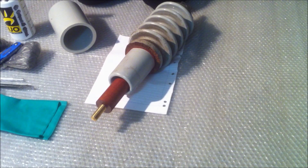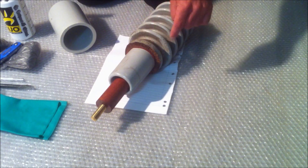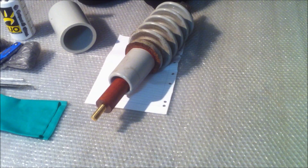Before we can mount this thing we've got to clean it, but the problem is because it's a really old unit, I strongly suspect that this is an asbestos-based gasket. So we're going to need to be careful when we're removing it. You can't just use power tools and grind it away or a file or anything like that. We want to minimize the amount of fibers coming off that gasket, and there are certain procedures we need to follow to stay safe. It's good to be aware of these sorts of things when you're salvaging and cleaning up old parts because there's always some safety hazards lurking.